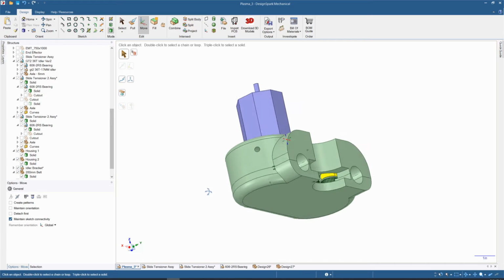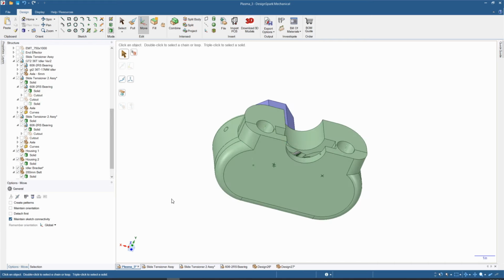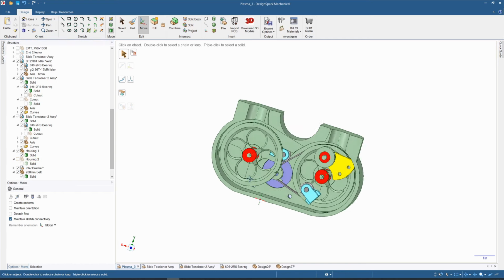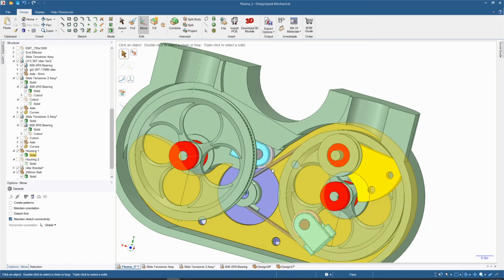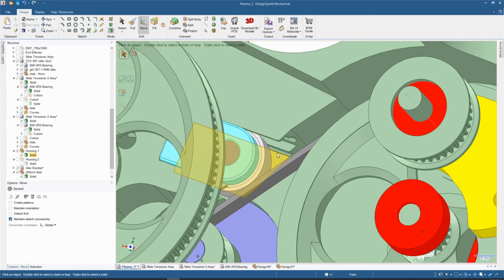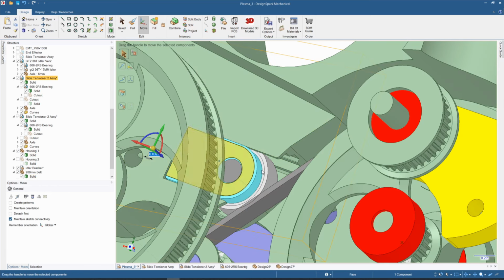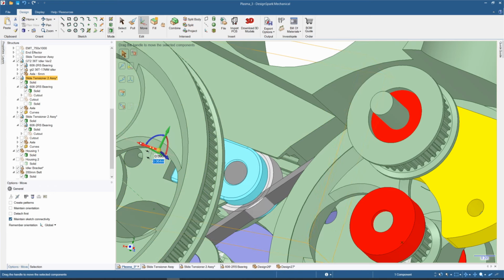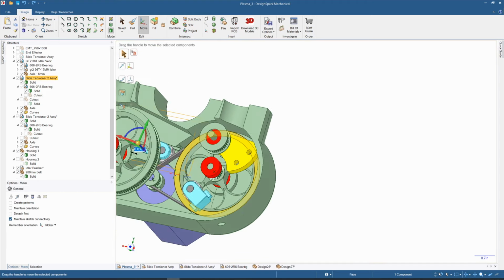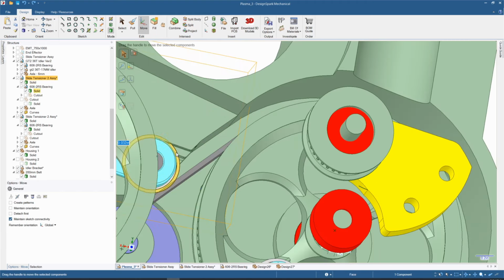So I am building this little gear reduction box, and I'm using Designspark Mechanical, and inside I have a belt drive system, and I have a couple of these tensioners that have to slide into a grooved slot to tension the belts. These tensioners have needed some real intricate little cutouts so that the block can slide back and forth to push up against the belt to tension it. Since I'm waiting on my parts to print on the 3D printer, I figured I'd take a minute and show you how I do these really quick.